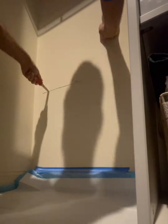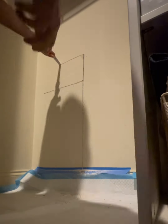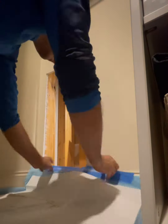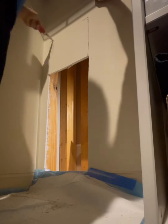These pee pads are great for drop cloths — just tape it to the wall and start cutting. Go from one wall stud to the other and push against it as you cut as a vertical guide. You can just score and break this last cut. I think I'll actually go a bit taller with this door — it's got to be at least 48 inches on the diagonal to fit a piece of drywall.